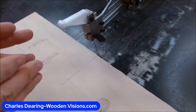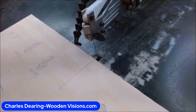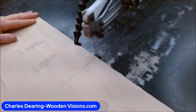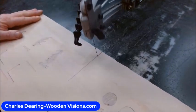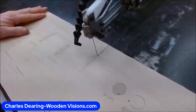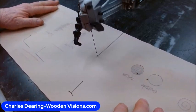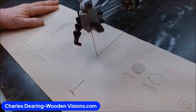It's so minute in visuals that you may not see it, but this is not necessarily how to cut a straight line — I will attempt to show you here. Just concentrate: when I get towards the end of the line — my eyesight's not real good anymore so I don't know how well I'll stay on that line. You barely notice it because it's not a real big movement. I'm moving the piece right now; you can slow it down. See right there — it was very minute, probably less than a millimeter — but I was letting the flex come out of the blade.